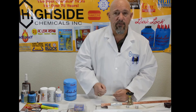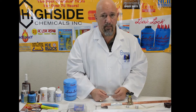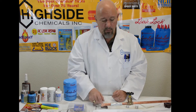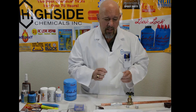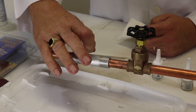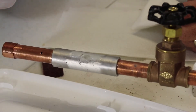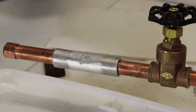It stays right there, and in just a few seconds you're going to have a 750 PSI bond and you can put your lines back in service, whether it's in air conditioning, plumbing, or the industrial industry. In 20 minutes, you'll have 1800 PSI, which will usually suffice for nearly any application. Take a clean rag or paper towel and wipe it off — just that fast the bond is created. You can take your fingernail and feel those bonding cells right over the top, how rough they are. That bond is completed and now we can continue our work.